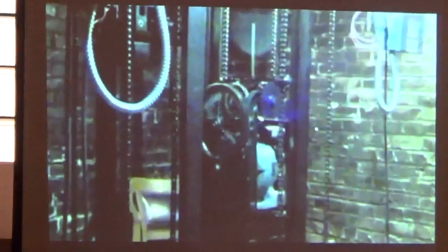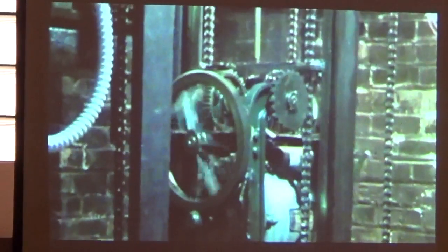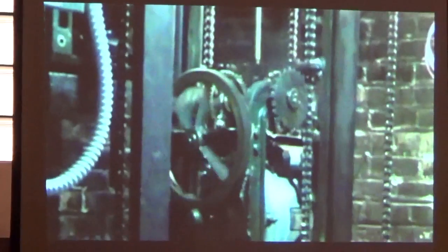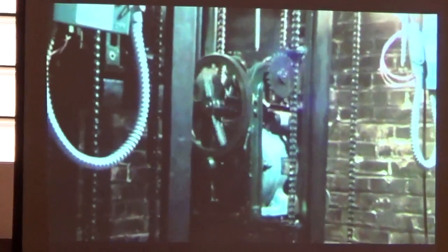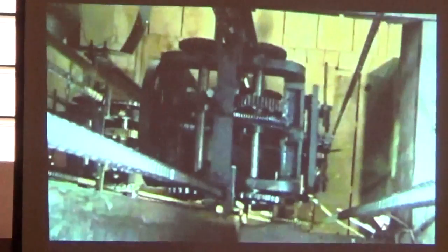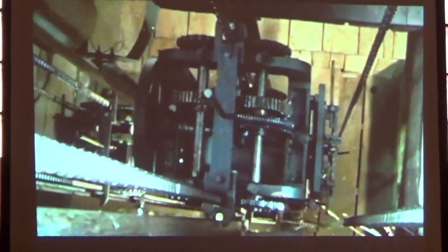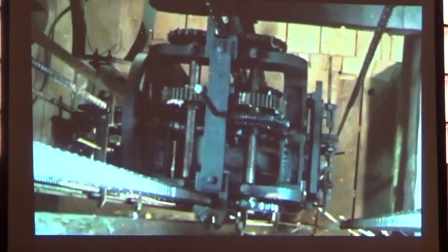This was invented by an employee of Mayer's and patented in 1912. And then the patent was assigned to Mayer. And there you can see the sprockets engaging the chain. Mayer's claim, and the reason he called it a constant torque system, was that in other electric winding systems the power goes off the train during the wind cycle, which complicates matters a little bit. The power is never off the train during this. It's always under tension, whether it's winding or dropping or just going down.